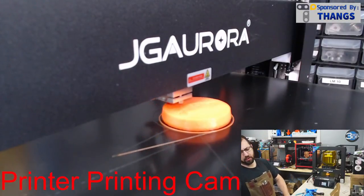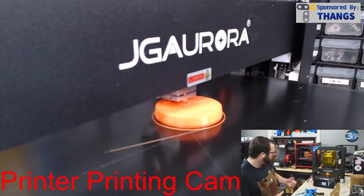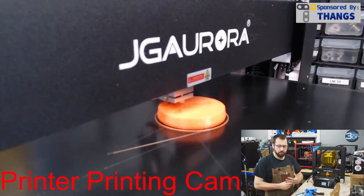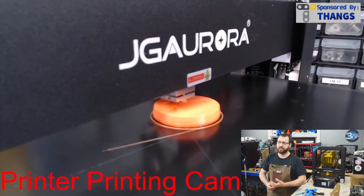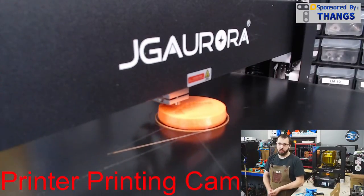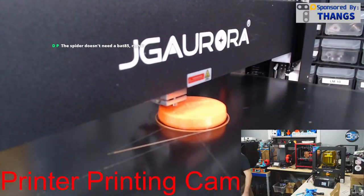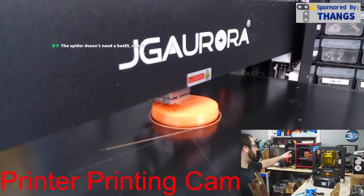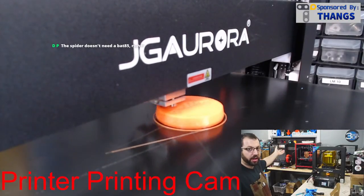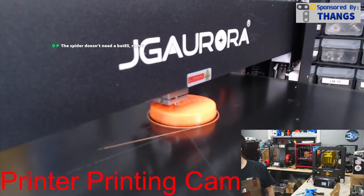What makes the inductive probe better than a BL touch? Cheaper, more reliable, and they're solid state, so they don't fall apart on you like a BL touch. A lot of us on the team have run BL touches over the years. They don't like heat. Inside an enclosed heated printer, they run into issues. And the inductive probe is plenty good enough because most of the enclosed printers, except for the switch wire, have a separate micro switch for adjusting your Z offset. So temperature drift isn't a thing you need to worry about with them.